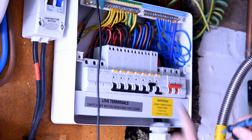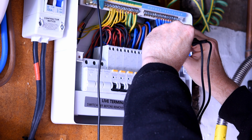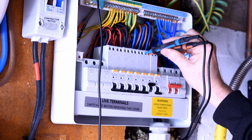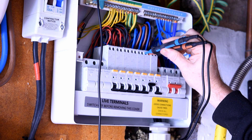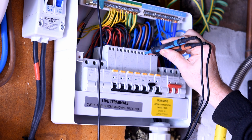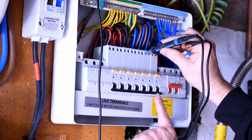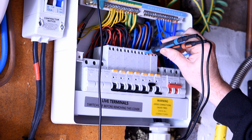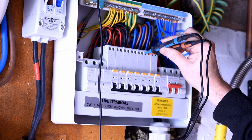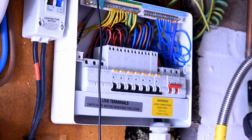The hob is the next one. We'll turn that circuit on and switch my tester back to AC. Neutral first, then line. Half - passed, greater than 2000. Half again passed. 33.6 for the first one times. 13.6 for the five times. And 9.2 for the second five times. Take those off.